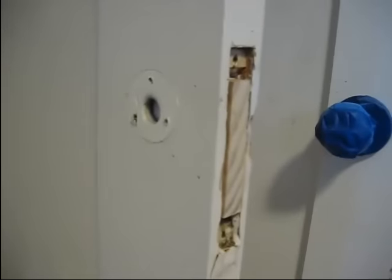All right, so here's a better example. I've removed the set screw, and there's actually a lock on the back of this one because this is a closet door. You can see it. What I'm talking about is that people pull on this thing and can't figure out - hey, I've undone that set screw, what's going on? The answer is that you have to unscrew it. It's real simple, but it's one of those things that you can get caught up on and get really frustrated. If I can show you not to get frustrated, then I've helped out. So screw it all the way off. It's a little easier because there's no knob on the other side. So then you just pull the other part right straight through, and then go ahead and take these plates off.